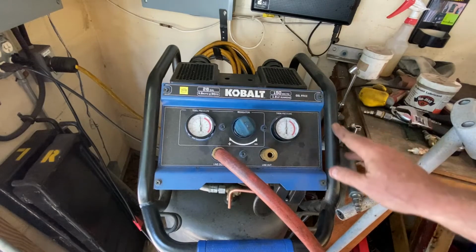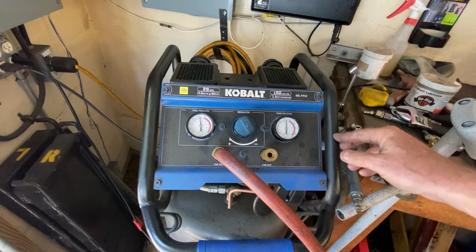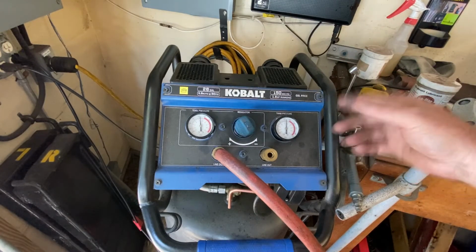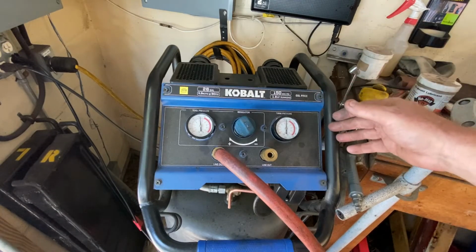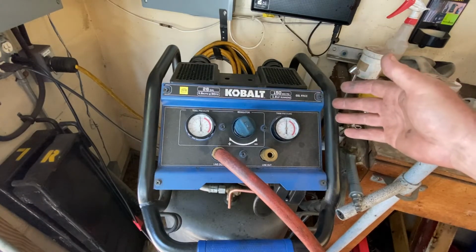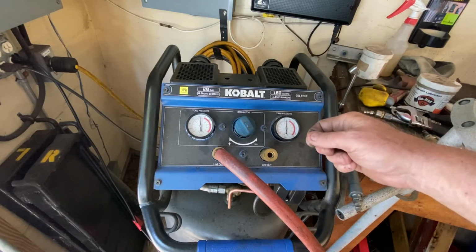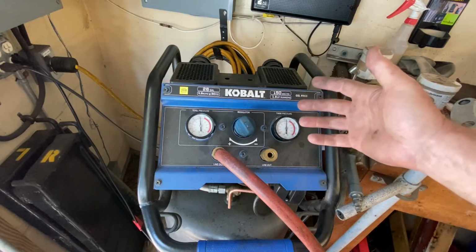So hey, it's not impossible. You can definitely do this with hand tools. You don't need a lathe. Just modified operations based off what I did by taking a bolt, cutting it off with a hacksaw, knocking off any burrs. The back end really doesn't need to be all that flat. Just use the threaded end, the machine end of the thread, and then drill a hole, put a little tap in there, whatever size you want, doesn't really matter.